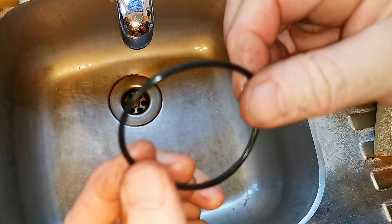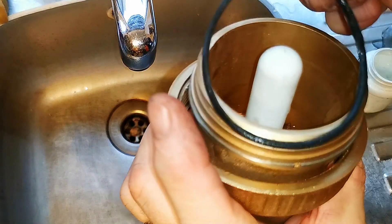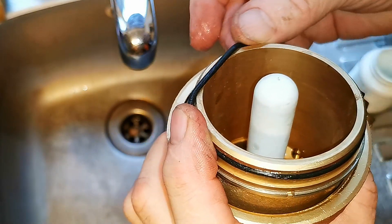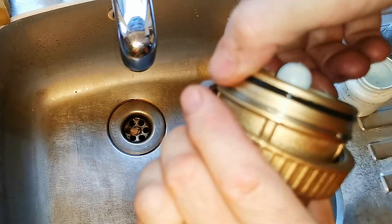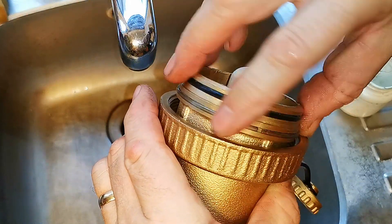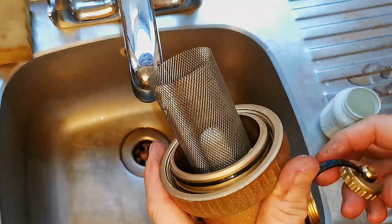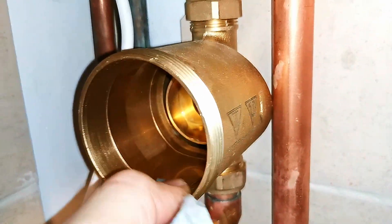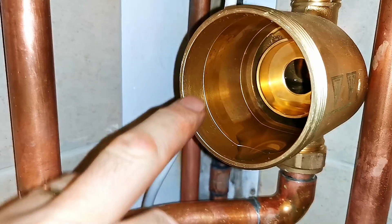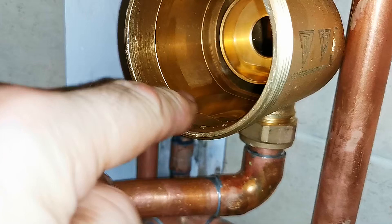I'll leave the o-ring part number in the description. You can see that's nicely greased up now. I'm going to slip it on over the top onto the filter and give that a little wipe around. I'm going to use a bit of extra grease and just wipe that around the filter so it makes a good seal, because I don't want any leaks. Now before I go fitting the filter, I want to make sure this inside surface is nice and clean — again this is where the o-ring seals. So I'm going to give that a wipe off, then get some silicone grease and just wipe that around on the inside, so the seal is going to make a good seal and I'm definitely not going to get any leaks. That's nice and greased up and ready to refit the filter.